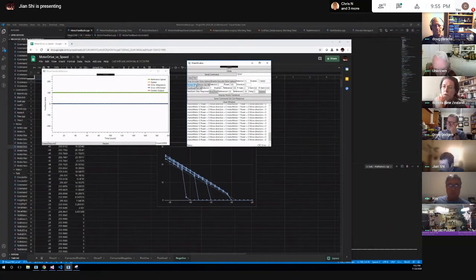Yes, he's got chains. Well, maybe two wheel is easier than four wheel, but I was planning to have all four wheels have encoders. It depends. There's nothing wrong with that, but if you have four wheels and they're not geared together, then to keep them in sync you're essentially gearing them together with your encoder. You have to have them all run the same. Each motor is its own little snowflake, so they're all different. So when you put encoders on each wheel, what you're effectively doing is gearing them together.